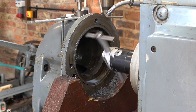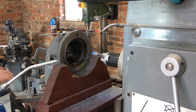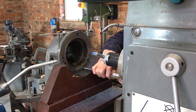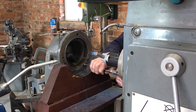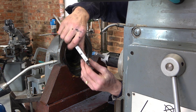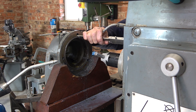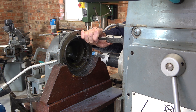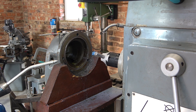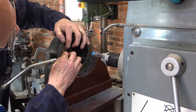I've sped this up a little bit, maybe 20% or so. Let's see what we've got then — down in this corner: 1.75; up here: 1.79 maybe; and here: 1.71 maybe. It's a bit of a rough and ready way to measure this. That looked like more — what's that, 1.76? We're into judgment time really, to decide just how much further to go. There has to be enough squash to seal the oil, but because it's only three millimetres wide, it needs to be able to squash sideways.